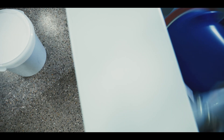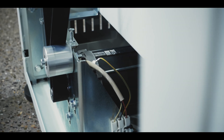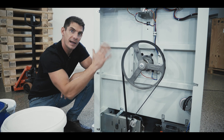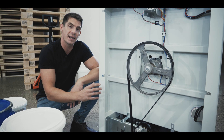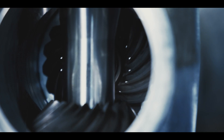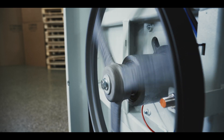The motor in here is the most powerful available, and that large motor is particularly suited to continuous usage and multi-shift operations. To transfer the energy from the motor into the mixing material, we have a heavy-duty transmission system. That transmission is a top-end piece of German engineering: specifically hardened steel bevel gears, robust connections and a strong drive belt ensure a reliable long life.